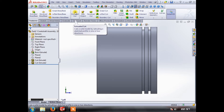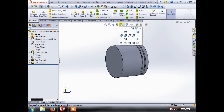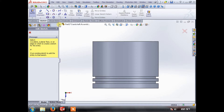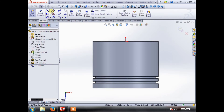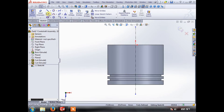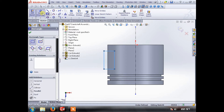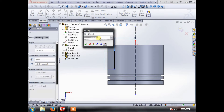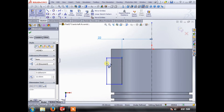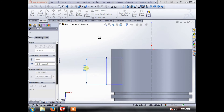I've just remembered that I called the wrist pin the crank pin — I shouldn't have done that, we'll go back and change that. Anyway, what we need to do is cut the wrist pin reliefs. We get the top view, go to sketch, sketch on the top plane, and I like to put a center line in. From this center line we can cut reliefs — we do a box from the center line, call it 22 millimeters.